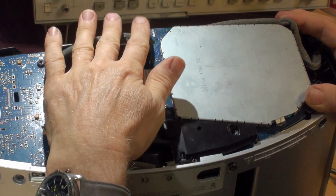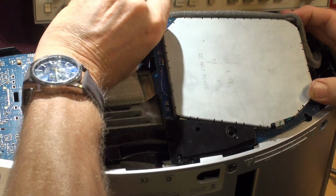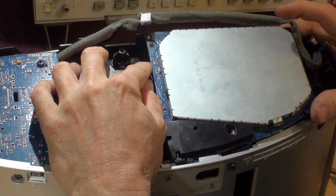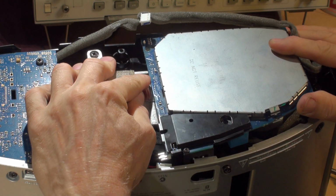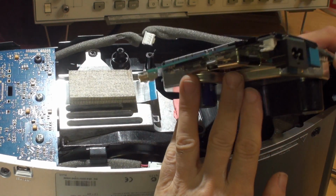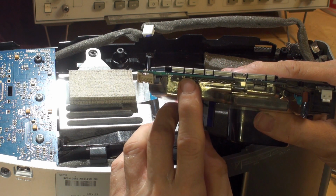So we've got this side down, this side up. Put our finger underneath, push the clip, and pull the connector out. Then that one's unplugged. Now it's just leaving this one, and then we just gently take this board, hold it there, and then just gently push away, okay, and it unplugs. So you can see there's the connector, here, into which that ribbon goes.